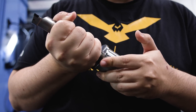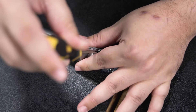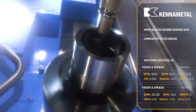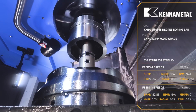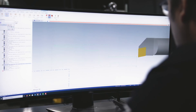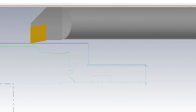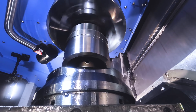I'm running a pretty big KM50 boring bar with a KCU10 insert. I'm going 600 SFM with a feed rate of two thousandths per revolution, and that'll give us a nice finish. The cut sounds really good, and I've got it backed off twenty thousandths right now, so I can dial it in to size and hit our tolerance.